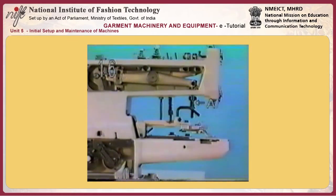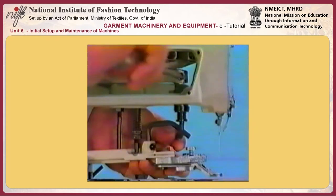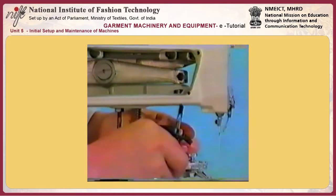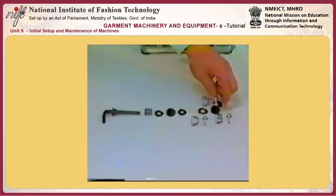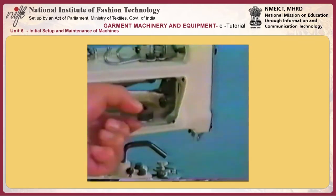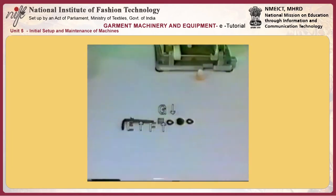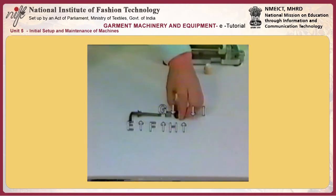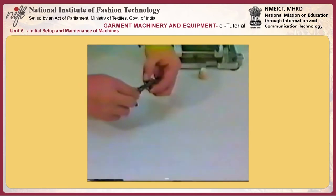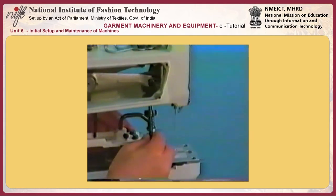Number 16, installing L-shaped lifting lever A. Attach washer B, cushion C and washer D in the frame. Set in place in the following order: cushion H, stop motion cushion washer G, moving knife return spring F, and L-shaped lifting lever E. Make sure that the sewing machine enters the complete stop motion state as shown by the arrow.